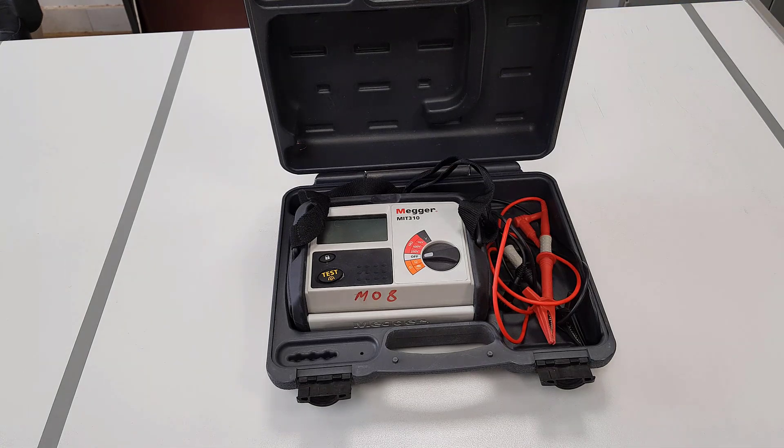In conclusion, we have covered how to inspect the insulation tester and the cables before using it. We've covered the various test modes that the instrument uses and when to use them. We've covered the safe use of the insulation tester and the importance of ensuring the equipment or installation is voltage free, with lockout tag applied before connecting the insulation resistance tester. Thank you for watching this video, which is part of our series on electrical testing instruments. We hope to see you in our next video.